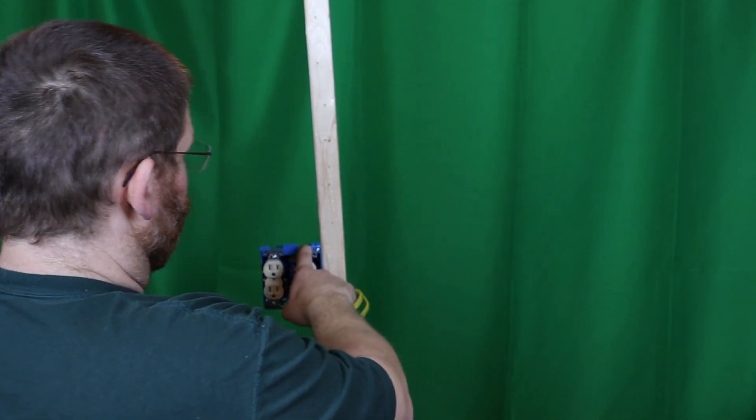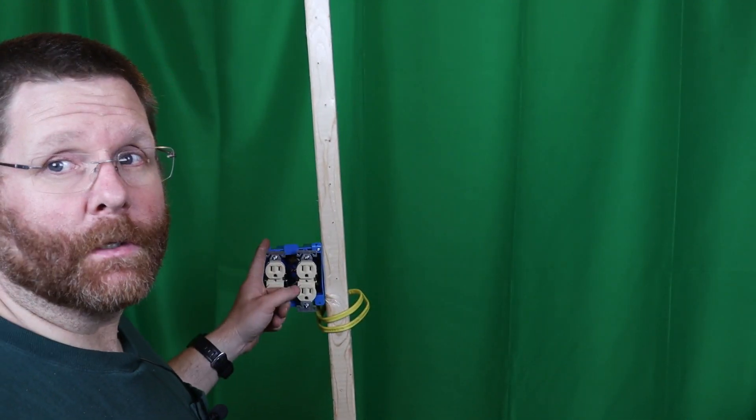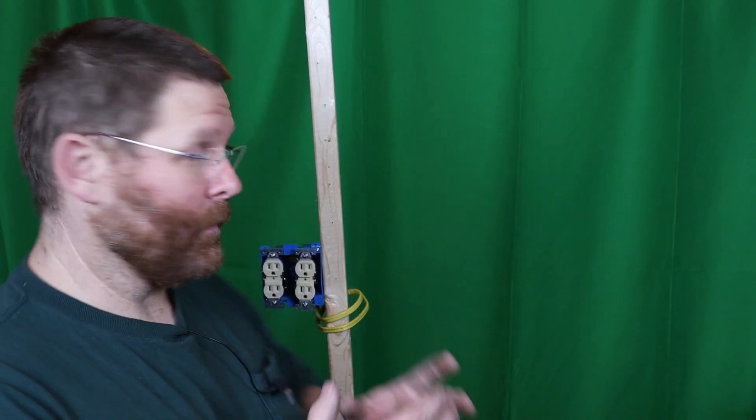For a recap: one more question I didn't address — if one wire comes in hot and one wire is leaving the box that is not hot, can you put the hot on one receptacle and the not-hot on the other? You cannot. It has to be pigtailed using one of the two ways I just showed you — that's the only way it will work. If you like what you see, like and subscribe, leave questions or video ideas in the comments, and we'll see you on the next one.